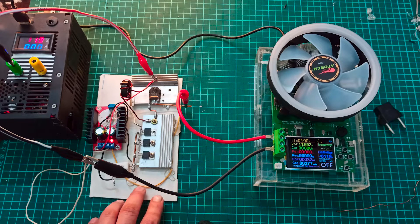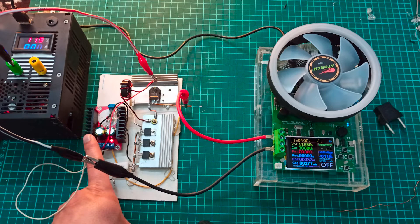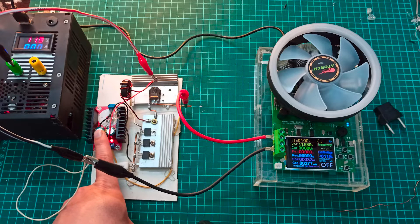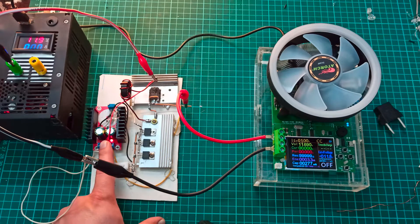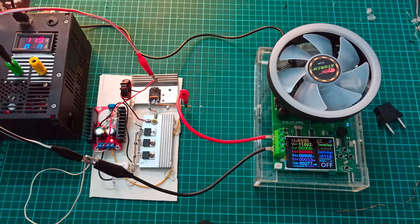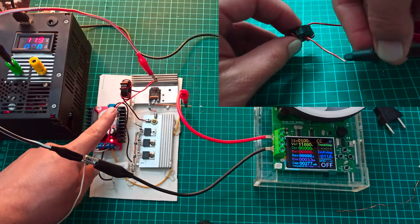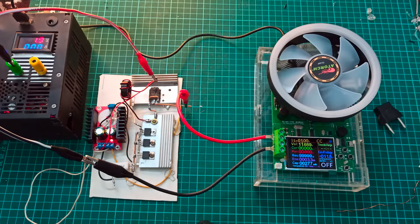As you can see, I have used three MOSFETs — these are IRF3205 MOSFETs connected in parallel. The gates of these MOSFETs are connected to the original circuit so that the switching pulses can be taken from it. The feedback is also given from this point through this yellow wire so that the circuit can continuously monitor the output voltage and regulate it as desired. We have also upgraded the inductor, because previously the original inductor wire was too thin for high current.